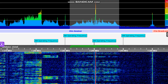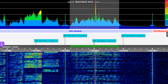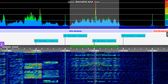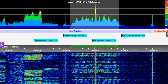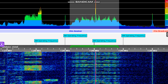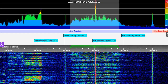You know, height above ground, length of antenna, orientation, frequency, skip or local. So you never know. I suppose it certainly could be, in certain circumstances, might work better than a dipole. I don't use a tuner in the AM portions of the band. I think if you have to use a tuner and really tune out a lot of standing wave, probably not the most efficient, but could also be a pretty good all-band antenna. So everything seems to be a compromise, but I have never tried a loop antenna or an end-fed or an off-center fed. I've always been a very balanced kind of person.